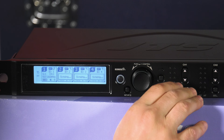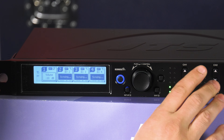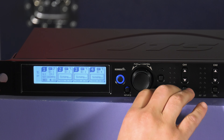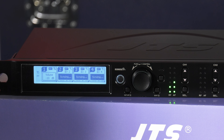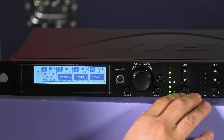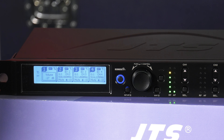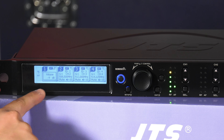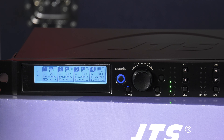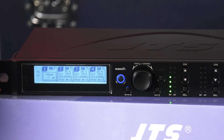A few things to note: you've got a volume control on each channel. Now this volume control is not the same as your sensitivity. That's something that is a little confusing. This volume is kind of like a fader — it's not your sensitivity, it's not your gain. So if I turn this way down to minus 26, my AF — my audio frequency — is still there. And if I turn it all the way up, my audio frequency does not change. That's because this is like a mixer or an output-level type thing. So be aware: if you've got a really weak signal and you see a lot of signal here but you're not getting anything on the mixer, it's because of that.